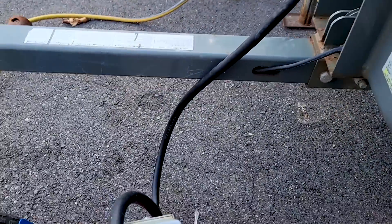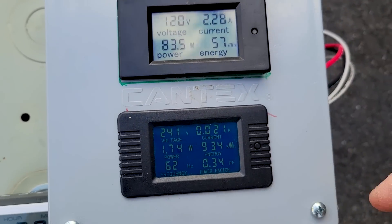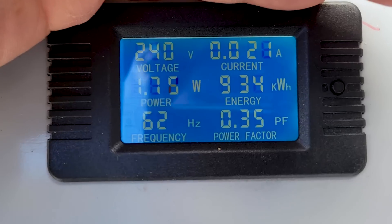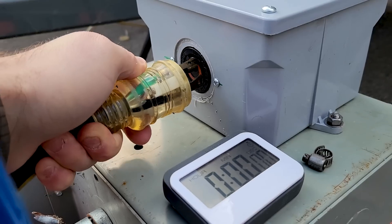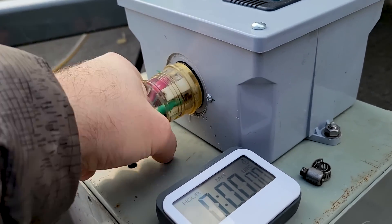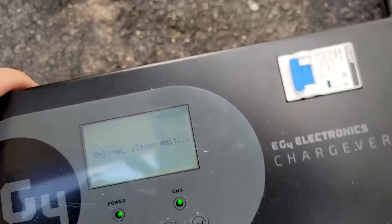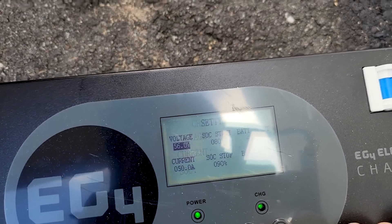With the main breaker on, we have 119 volts going in. The transformer itself is consuming 83 watts, plus these displays. And we can see 240 volts out — that's exactly what we want. This generator has a 120-volt generator head with a main circuit breaker of 50 amps, so I need to make sure we don't exceed 50 amps on the 120-volt side. The 90-amp setting on the charge verter seems to be working out well — we're maintaining 45 amps on the generator head right now. So I'll leave it the way it is, and once the fuel level hits five quarts we'll begin the test.